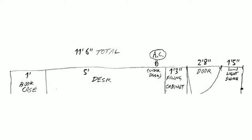Here's the top edge of the room drawing with the measurements taken in feet and inches. And you're going to use this scale to do your drawing. Notice that 1/2 symbol on the top right. That will be your scale. And you'll also notice that it has a lot of small fractions of a foot measurements on the far right. Then, reading left, the scale starts at 0 and moves forward towards the left of the scale. Let's work our way across the top edge of the room using our architect's scale.